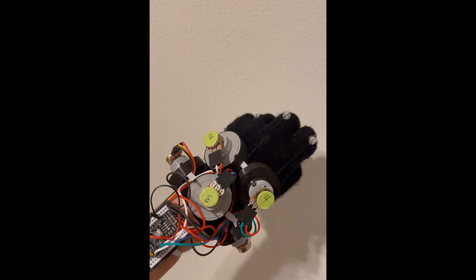Now let's talk about actually getting the gloves to work in VR, because there was a ton of work that had to go into that. My Python demo was just a tiny start. Currently my gloves are working in VR using a custom SteamVR driver that I originally programmed myself. It gets the data from the Arduino, and it also needs the position of the hands — it gets those by either using a SteamVR or Vive tracker, or something like an Oculus controller that you can strap to your hand. This was a really tricky process to program because the documentation for SteamVR drivers isn't that great.